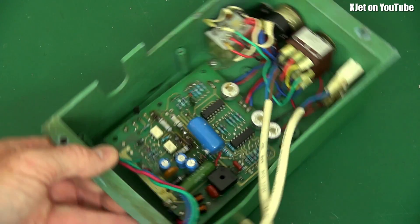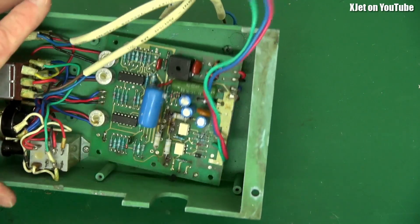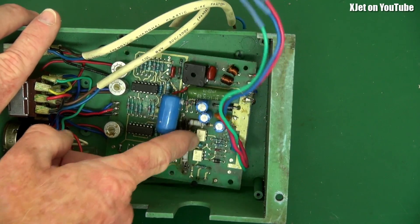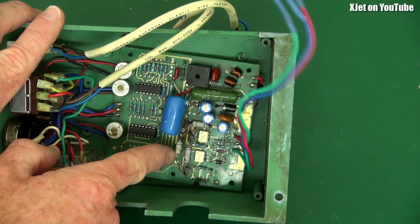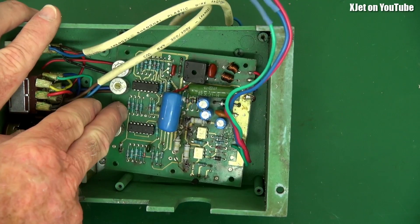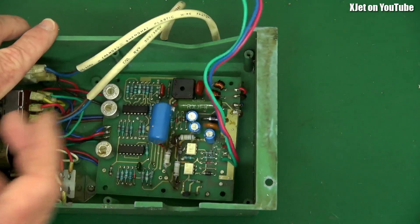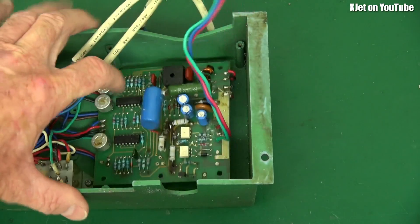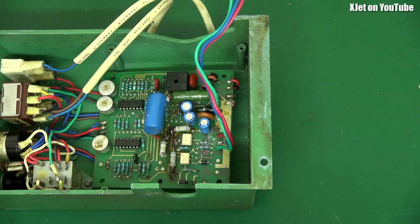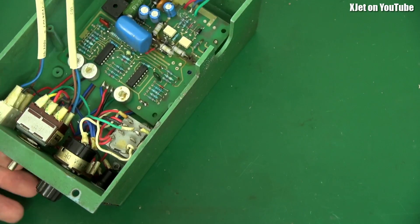One thing I will definitely do is add a transformer — this is already somewhat isolated. You see these little white things? They are opto-isolators, which means this very low-voltage circuitry is effectively isolated from the high voltage over here. But the voltage to drive these still comes through these very hot resistors. I'm going to put a little transformer in here to drop the voltage down to drive the low-voltage side of things, and I'll still use opto-isolators. So the power stage will be the only part of the circuitry with any connection to high voltage — I want transformer isolation so that even if something broke down, I won't have high voltage appearing on my switches or knobs. It's going to be super duper safe.